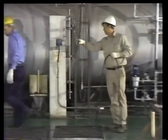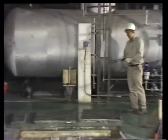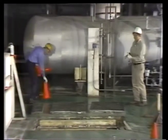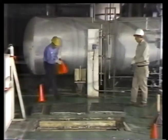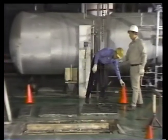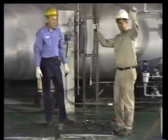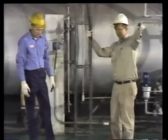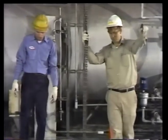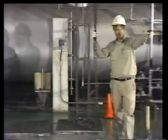The next step is a safety consideration. Norris's helper gets the last two safety cones and puts them in place. So now, the entire work area is surrounded. When the cones are taken care of, the hoist is repositioned, so it's once more over the load. Then the slings can be reattached, and everything's ready to lift the load again.